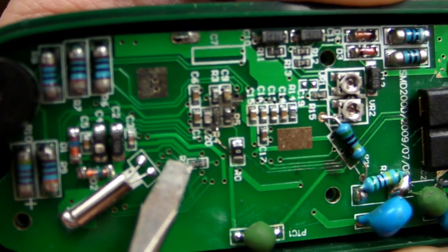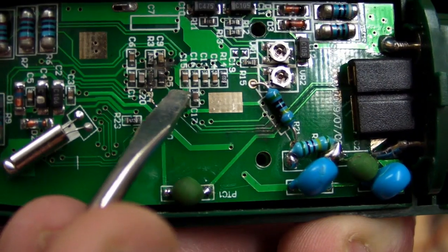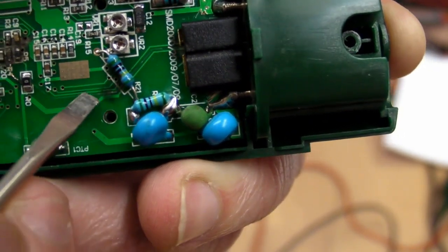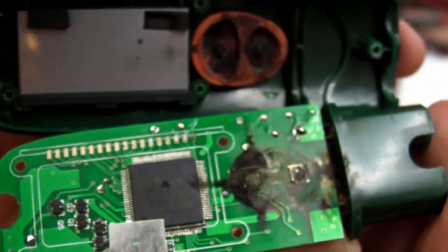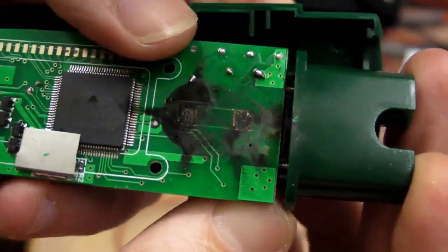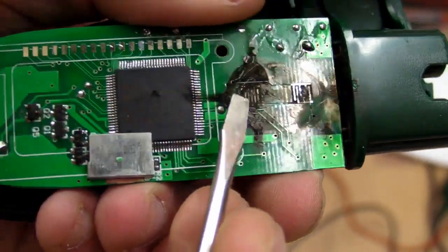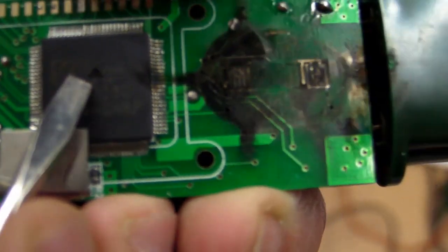What a piece of shit. Now if you're actually curious to see what damage was done, there's a capacitor down there which is blown. There are a few passive components around here which are blown and nothing else on the top. They've got a PTC there and a couple of MOVs as well, but they didn't actually blow. But this input resistor here is a bit charred. There's some charring on there. But the real issue is if you flip it over — bingo! Look at the soft rubber switch. Look at all the charring on that rubber switch there. Unbelievable! And the bottom side of the rubber switch contacts, it's all charred completely around there. So imagine if you had that thing plugged in and you had your fingers on those buttons — the explosion could escape out through the buttons. It's crazy.